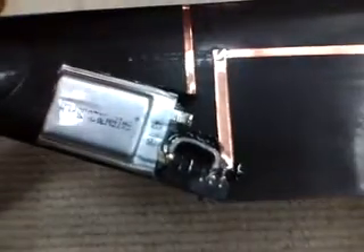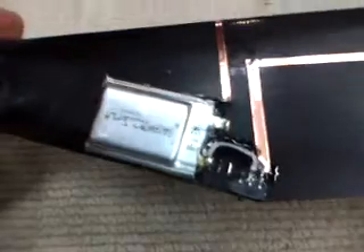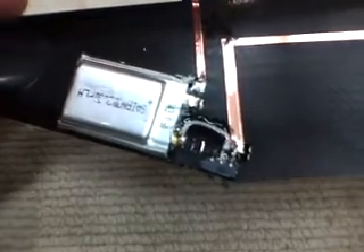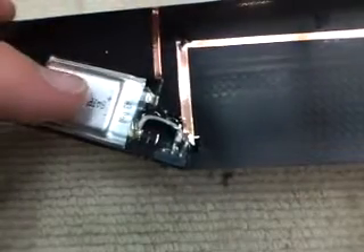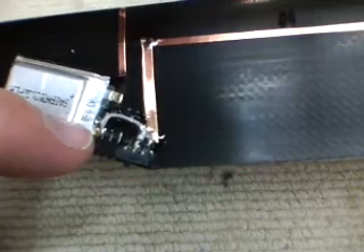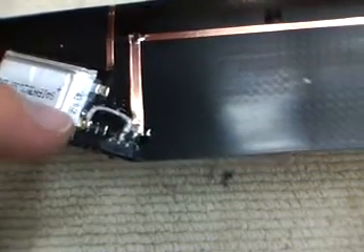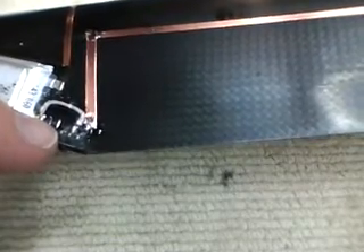What I want to show you here is we've got our first battery mounted. I had to switch over to an 80 milliamp hour lipo because I snipped the edge of it with a pair of scissors, so the 240s are bad now — at least one of them, and I don't have a matching set. What we've got here is the battery mounted with servo tape. We've literally butted the negative terminal right up to what's going to be the negative side of the charge port. I've put a white jumper in place that goes over to the middle terminal on the switch, and the other side of the switch has been soldered directly onto this trace.